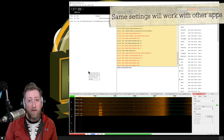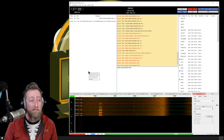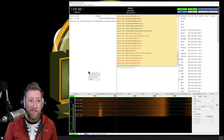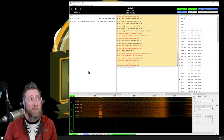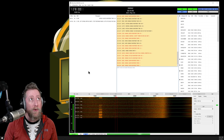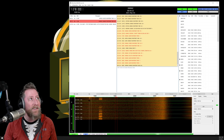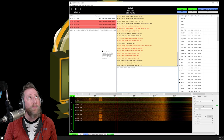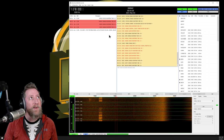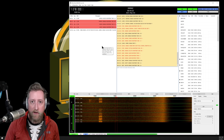What I would do at that point is go do all the JS8Call things — look at my top 5 tips for doing digital radio over a computer. Change it over to the meter function on your radio, do a tune again, and your ALC might be really high. Just dial it back down with the control right there and you should be good to go. Make sure your SWR is also within a respectable range, then go ahead and find an empty spot in the frequency space. It'll adjust it for you — click heartbeat and ACK. You'll start transmitting. My SWR and ALC are solid. I am transmitting out of my 705 right now. I am only putting out 10 watts. I got a heartbeat — two heartbeats — three heartbeats. Negative 8, negative 21, and negative 11. I'll take it. My station is configured correctly.